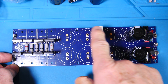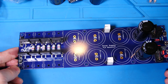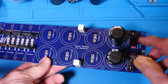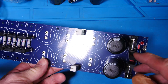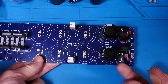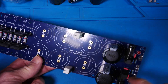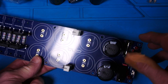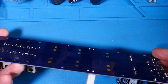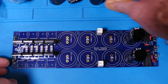Right now I've only put two caps in — one in the plus row, one in the minus row — just to see how much ripple we get with two 6800 µF caps before adding more. The diodes are standing up and I'll decide what to do from there. The fuses are in: I put a 5-amp fuse on each side, snapped in, and I still need to clean up the rosin with cotton swabs.